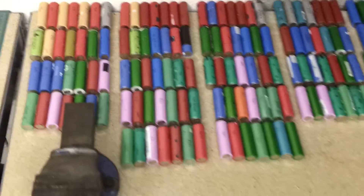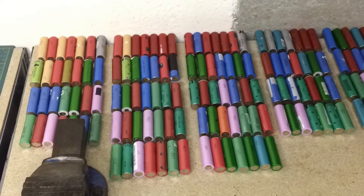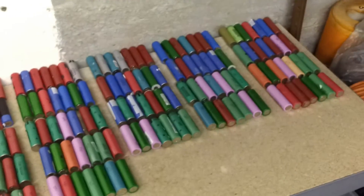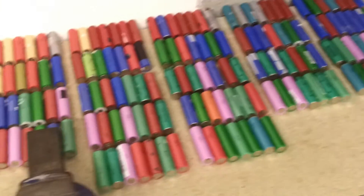I'm going to add up the amp hours on each group of cells I've got here — firstly to find out what my amp hour will be per pack, and then write them on a piece of paper. I'm going to try and balance them up a little bit more, swap some cells between groups if they're a little out. That process will hopefully enable me to get rid of this one rogue cell, which is a bit annoying to have.